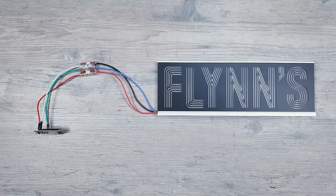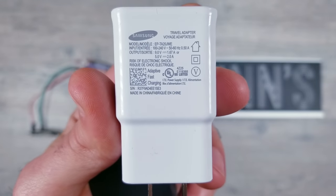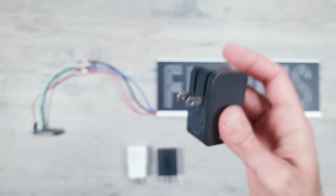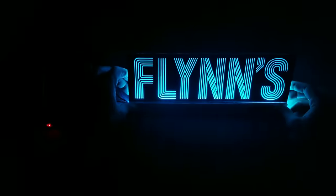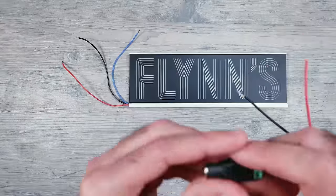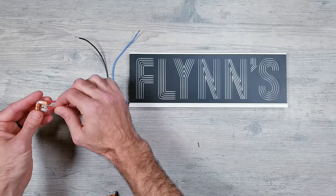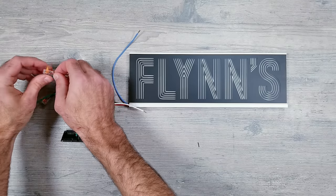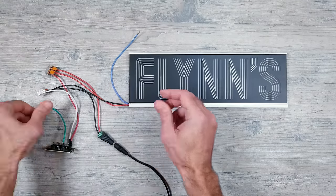For powering them I'll show you a couple of different ways. For the first option, since there aren't many LEDs, I'm just going to use some old plugs and a micro USB cord. I tested this with a 5V 2A, a 5.2V 1.8A, and a 5.2V 2.5A plug and they all work fine. If you have a cheap power unit you want to use, the first way is to use a barrel plug adapter and put in your red voltage and black negative wires. Then use a three-slot WAGO connector for the red voltage wires and another for the black ground wires. Take your ESP32 device, combine the red wire with the others, add the white ground wire to the black wire connector, connect the green and blue data lines together, plug it in, and you're good to go.